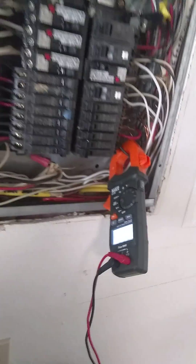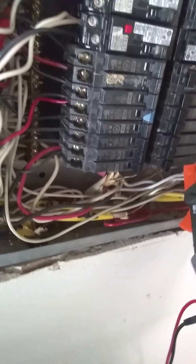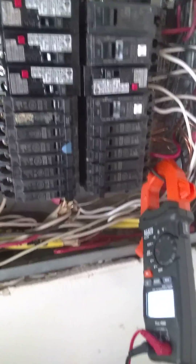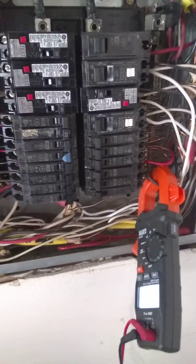What's alarming about this situation is how hot this breaker is to touch. I don't really usually like to do this barehanded, but this breaker is way way too hot. I just changed the 60 amp sub-feed breaker that was overheating — it's a GE 60 amp breaker and it's one of the bigger breakers. It was overheating severely and would trip after 30 minutes, even though everything in the sub panel was only drawing about 25 amps.